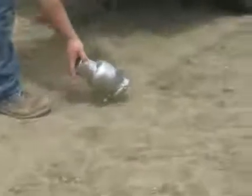Empty the speedy moisture tester and recover the two steel balls. Examine the contents for lumps — if the material contains lumps, the test should be repeated.